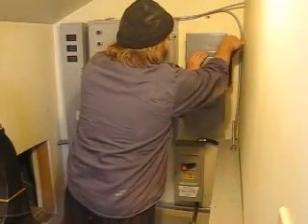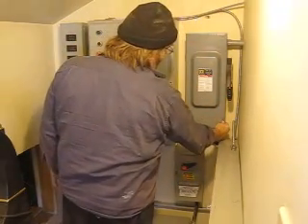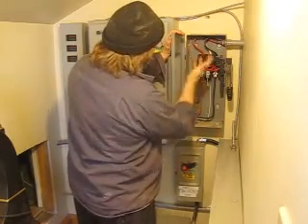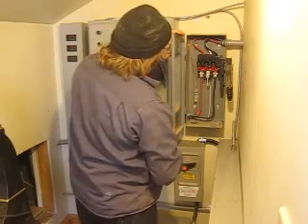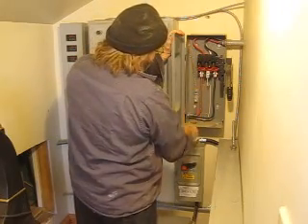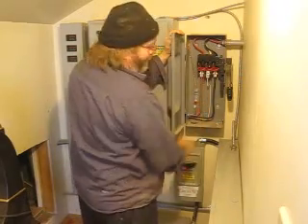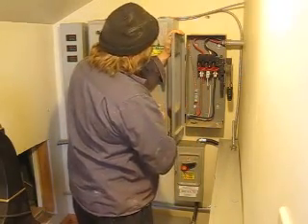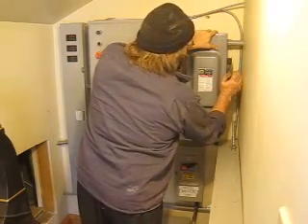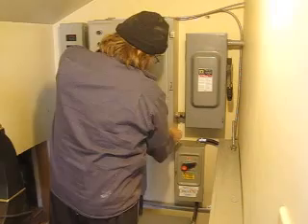Most electrical contractors are not going to use salvaged equipment because banks won't accept it. What we have here is a single-phase disconnect. I'm bringing power from my sub-panel to here — in this case I've run wire for 100 amps but I'm only feeding it with 60 amps currently. Because the salvaged wire was a three-phase wire, I did bring the common back, which gives me 110V in the box for my controls.